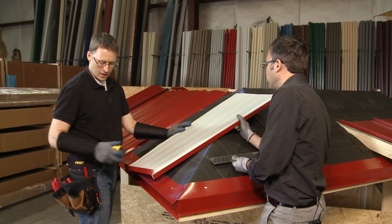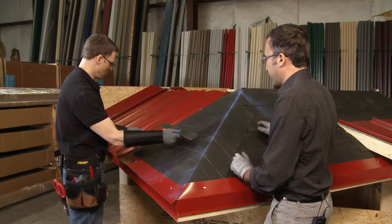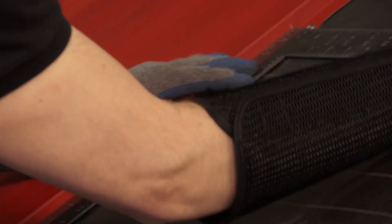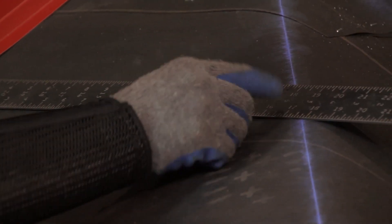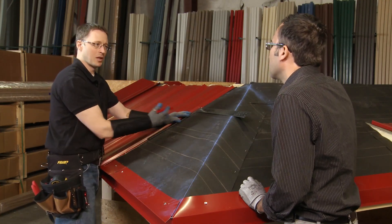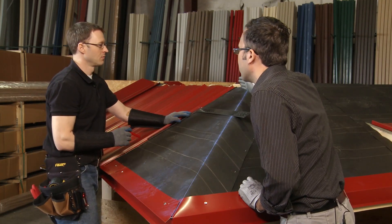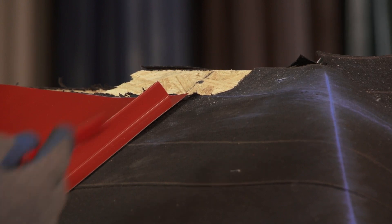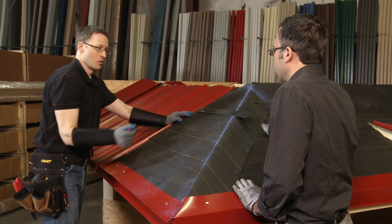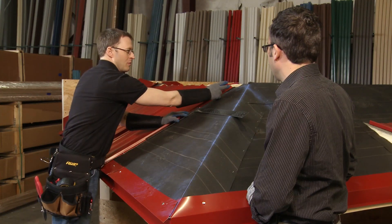If you look at the square, you can see I've made a mark at 17 and a half inches. Lining the square up with the inside of the last panel, we slide it up until our 17 and a half inch mark hits the hip. We can see right there is where we've hit, and we transfer that measurement over to the panel by making a mark. That gives us the short length of the panel. So just to recap: this panel has a measurement from here to here, and then we have an angle to calculate based off the square.